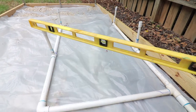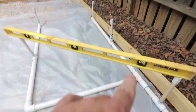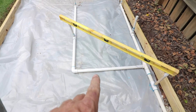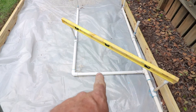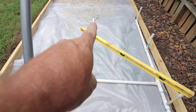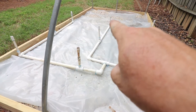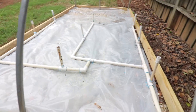I don't know if you can see that, but the bead is perfectly in the middle. I added the third head right here, so these are all right at 30 inches apart. I'm going to cut into here — the pieces I have available — I'm going to put a T in here and come out to there, come over to here, put the head right there for having three right there, and then run it over to that edge and put the three in right there. So the nine risers are in and they're all level across the top. I used a four-foot level, actually leveled them all off of that center one right there.